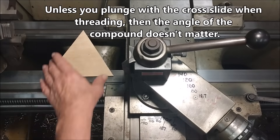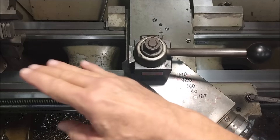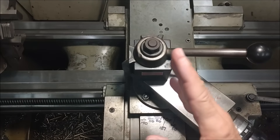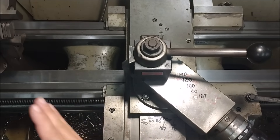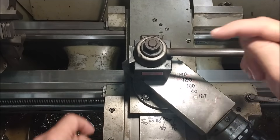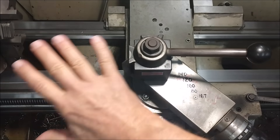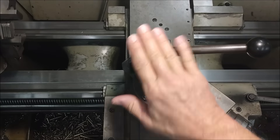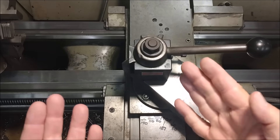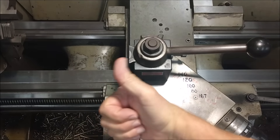This has to become second nature for you to run a successful thread — lead screw within the boundary, tool perpendicular to the work. Next best piece of advice: don't let the first thread you run on your machine be the first thread you need. Put a piece of scrap in there and play — see the engagement, check the half-nut feel, put a little drag on the hand wheel. There are a lot of videos on this channel with advice on how to do just those things, so check the playlist on lathe operation and general lathe setup.